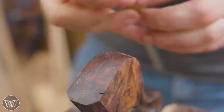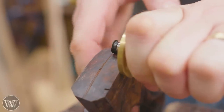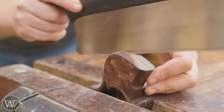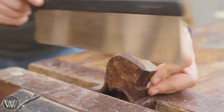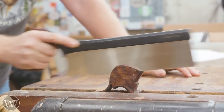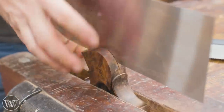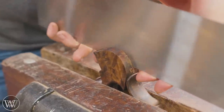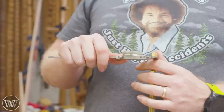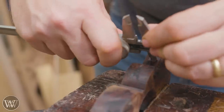It's nice with the saw - you can grab a piece of wood, but for all the rest of it you could make it yourself, but we're going to use what's already been made. The first thing I'm going to do is put a center line down this. You can see it's actually ever so slightly thicker at the top. Marking from both sides allows you to see any variance, and I'm using a saw with a slightly thinner kerf than what I need, so that this will actually match the kerf of the plate, because the kerf of the saw is wider than the plate and therefore you need to find a saw with the right kerf to match the plate you're sticking into it. I want it to fit down in and be pretty snug.